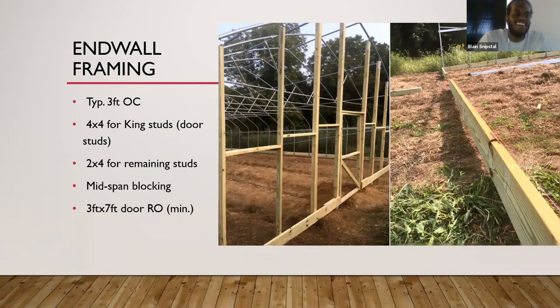So yeah. What about a rolling barn door? Do you find that has the same insulation challenges? Rolling barn doors are awesome. You can buy, what are they called? Sliding door brushes. They make them in all different sizes. Install those on either ends, actually in all three sides. Well, there's four sides to a barn door, but don't install it on the door's floor side. But on the two vertical and the top side, you install that brush. And that's going to give you a nice seal. That'll give you a nice seal for sure.